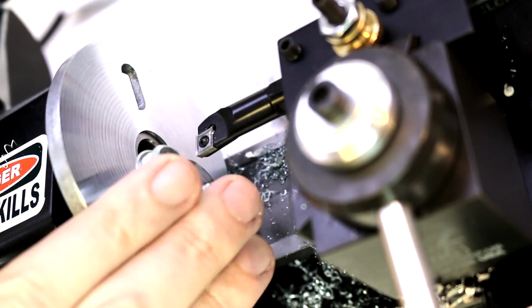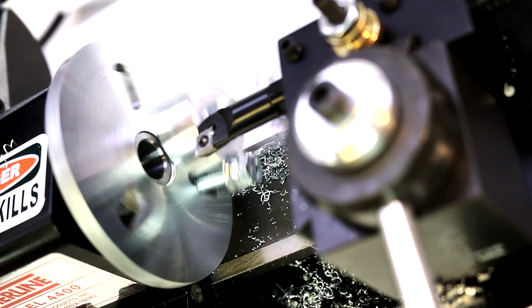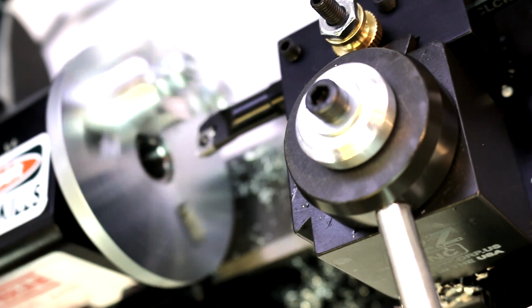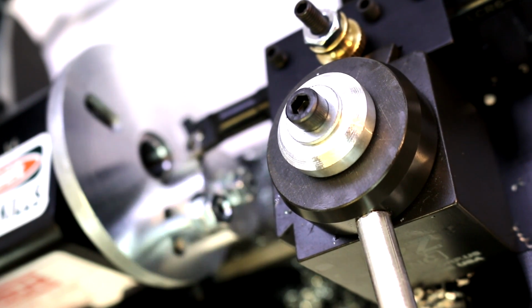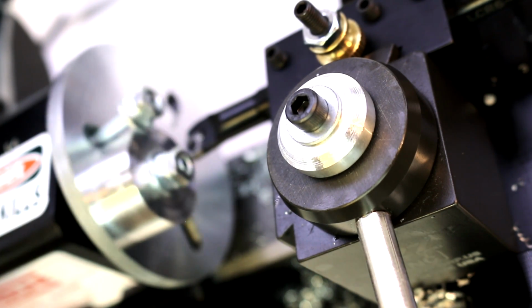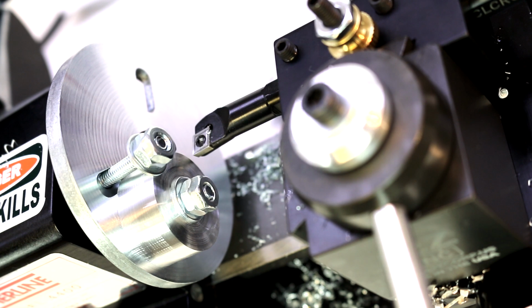And we have a lot of stuff sticking out here. Obviously, we shouldn't be putting our fingers in around here anyways when it's running, but we want to make sure and keep cognizant of that. We want to make sure that we're not going to impact our cutter. So move it around, move the cutter in, and as you can see there, we are actually beginning to impact our cutter. So we're going to have to do a push cut on this and see if that will allow us the clearance we need during the push cut.